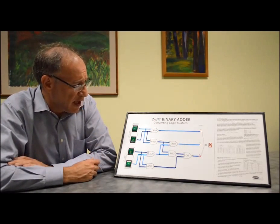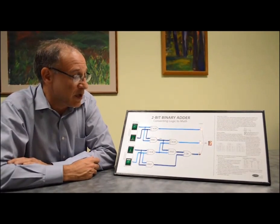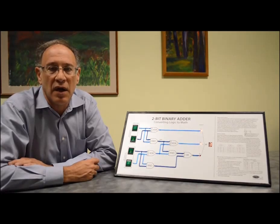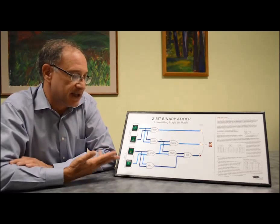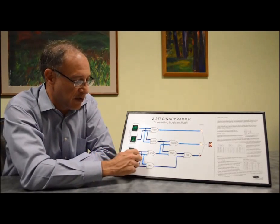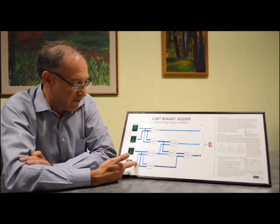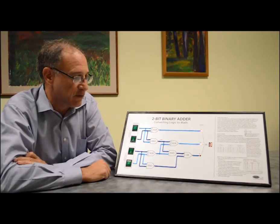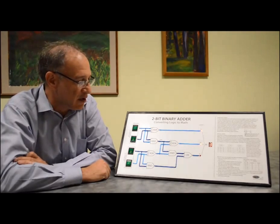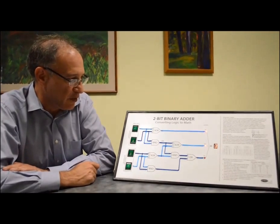We had a choice — we could have implemented this with regular logic chips. We chose not to and used an Arduino. It turned the logic into a little bit of a programming problem, but not particularly difficult. The nice thing about using the Arduino was that there was a shield that allowed us to turn on and off the electroluminescent wire. The electroluminescent wire runs on about 200 volts AC, very low current. And of course the LEDs run on standard TTL level voltages.